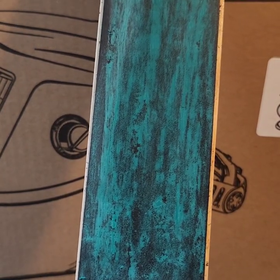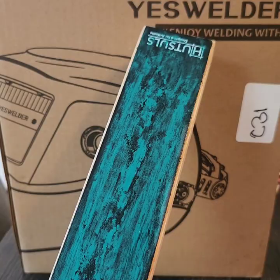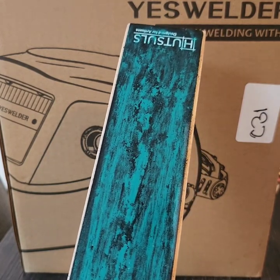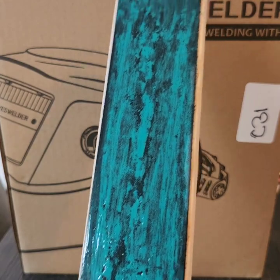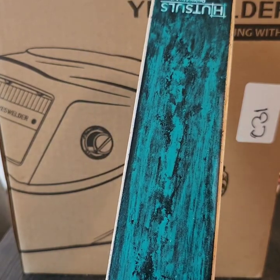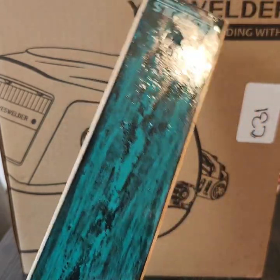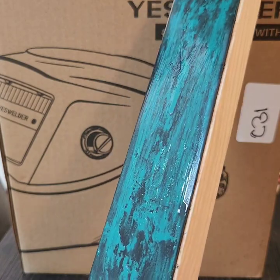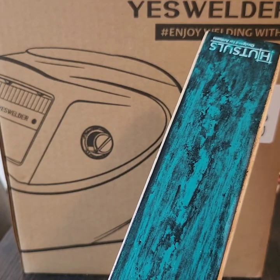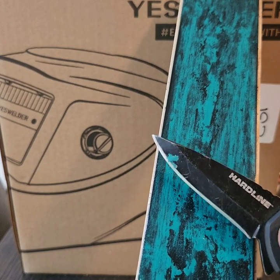That's the basics — hold on a second, check that blade out. All right, my surface was a little too dry. Per Hutzel's instructions, you lightly moisten your fingertips and apply a little bit of olive oil to the surface — just about two drops smeared right over the top. It looks like more than it really is, but it's definitely only a tiny little bit. Then you're going to continue working the blade.